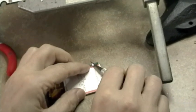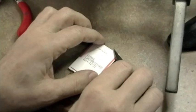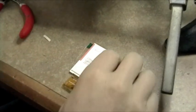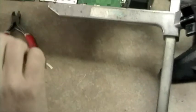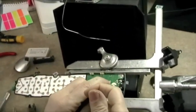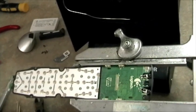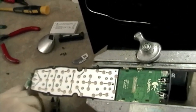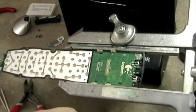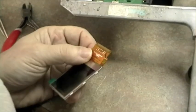To take off these nibs you can just pop them right off with an X-Acto blade. Now we're ready to actually do some soldering. I'm going to lay down a bead of paste flux, and I'm going to remove the cover on the double stick tape on the module. This will help hold the module down to the board.